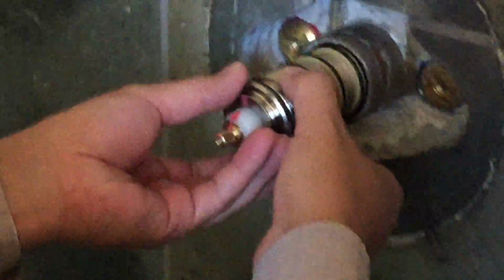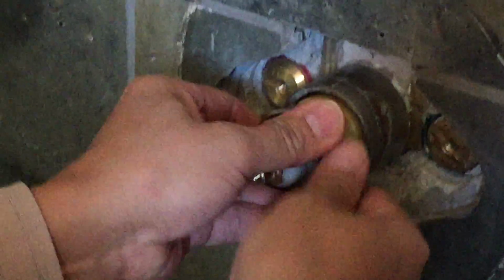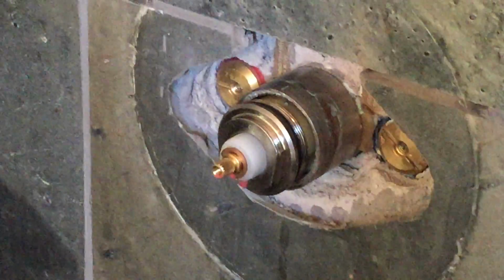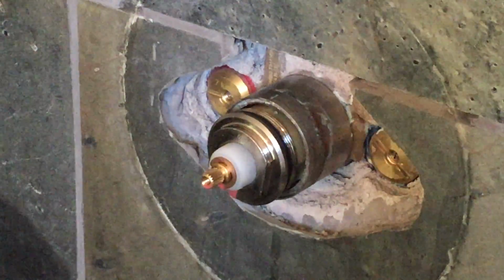In the replacement cartridge, you will see not only the cartridge itself, but also the temperature control stop. We're not going to use the temperature control stop right now. Set that aside. In the next video where we calibrate the temperature, we will use the stop itself. For now, we will be reinstalling the replacement cartridge using our torque wrench.